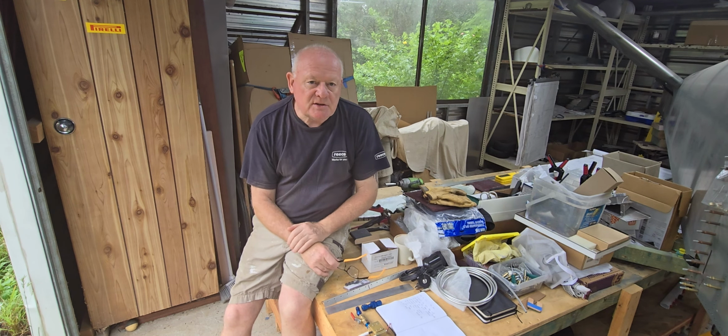So I want to ensure that all my work behind the instrument panel, tidying up any of the little tiny works that goes in there, is all complete prior to filling that tank. I don't really want to be emptying the tank and pulling it all apart to get access if I've forgotten something. So now's the time to do it.